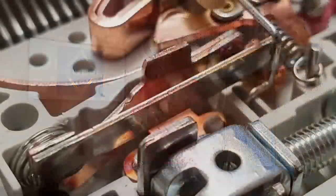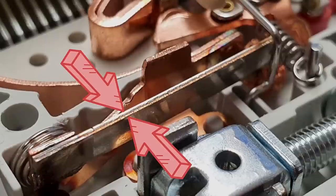But why are there two different components? It's because we want the device to behave differently when different faults occur. If a circuit gets overloaded, it's likely to only be overloaded for a short period of time and probably only quite occasionally. This short period of occasional overload is very unlikely to cause any damage to either the cable or the property. So you don't want the protective device to overreact when there's no real danger — bearing in mind that small sustained overloads can be damaging and should be corrected at the design stage. The bimetallic strip is made up of two different pieces of metal joined together. The two metals expand at different rates when they get hot, causing the strip to bend. Once this bending reaches a certain point, the breaker trips and disconnects the outgoing circuit. This is the thermal part of the circuit breaker.